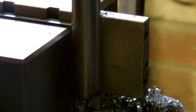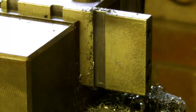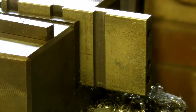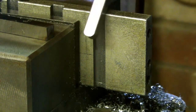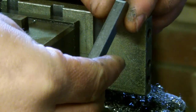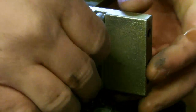For the sake of proving it works, I think we've got a reasonably good example there. Now I have to time it so that it stops on the up travel - there I think. So that's well and truly out of the way. We have cut quite a nice slot there. So here's our 8mm key - if we try and put that in there... a little bit stiff perhaps. Maybe it's cut at an angle inside the metal. There's a little bit of a nick on this key somewhere and that's probably why it won't go in. Yeah, there's a nick there - so if I put it in there, it's quite a nice fit.